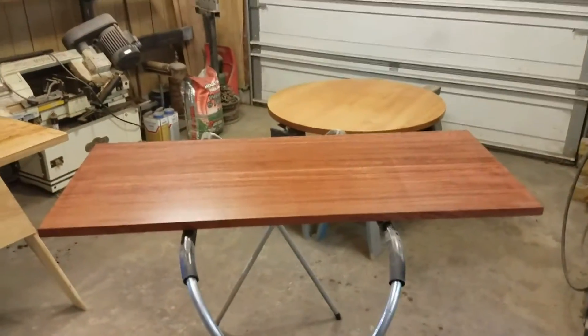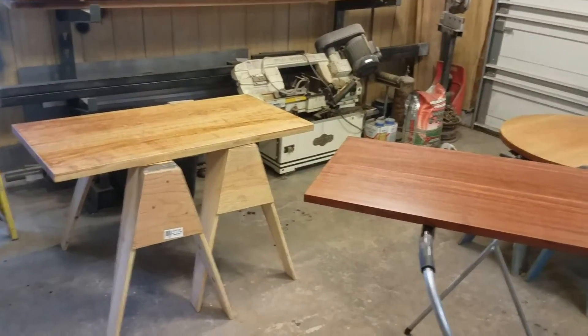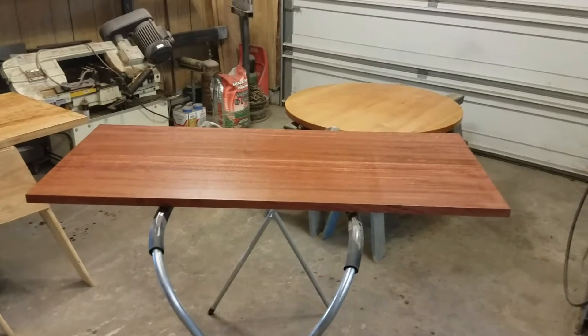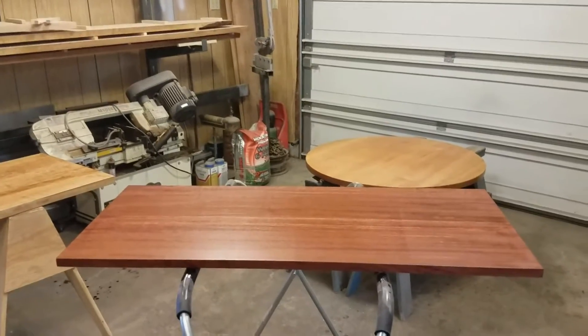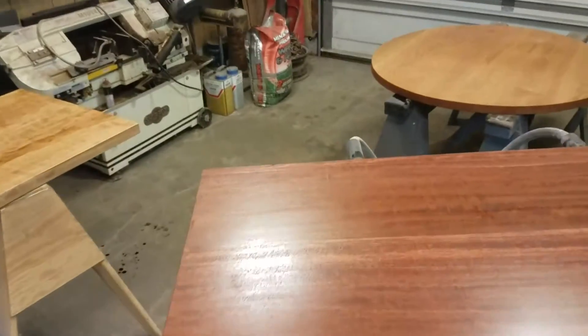These two are getting their second coats of finish, and this one is getting its first coat. This cherry coffee table — I call these the color coats. I'm not too worried about these particular coats; they're still going to be sanded down pretty significantly. The third and fourth coats are really the ones I'm picky on, where I'll burnish everything and get the dust nibs out. If you see any streaks, it's also because the finish is still drying and dries a little unevenly until completely dry.